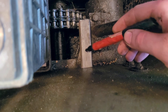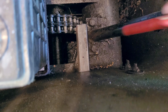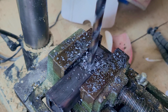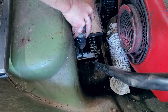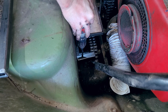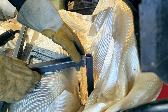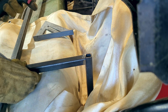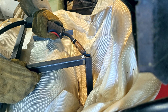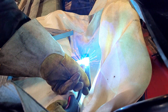Building the support arms is a pretty simple task — they're more or less all built the same way. First, I find a place on the frame to attach the support and mark the location for the bolt hole. Then the square tubing gets drilled out, and using that same tubing as a guide, I drill out the frame on the Argo. Finally, I weld in the remaining parts of the support, using a triangle to keep everything straight. You may notice that instead of cutting a 90-degree corner at two 45-degree angles and welding them together like every other corner on this build, this one I just butt-welded — equal parts an experiment and laziness.